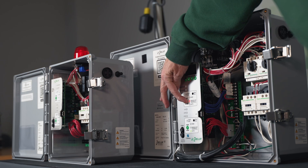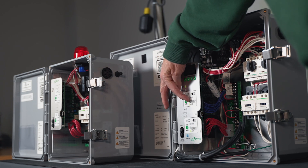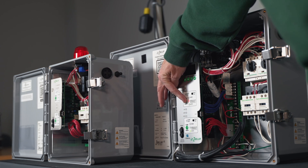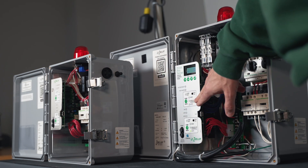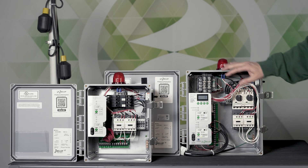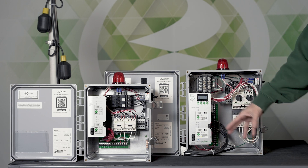I'm going to put it back to auto. If I go into off and just hold the button for about six seconds, the LED will blink red instead of solid red, and now off is off permanently and there will be no alarm. That's the idea of the smart HOA — to try to prevent accidentally leaving it on or off, which can cause either property damage or pump burnouts.